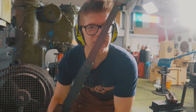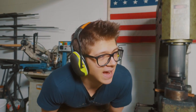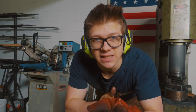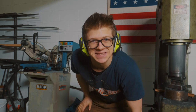So I've made two different sizes. One is 23 by 10 and one is 20 by 9. We're gonna see if that helps us get any closer to reducing that flashing and getting a very nice and clean forging. I also found pushing in, it's very difficult to do because it takes such an aggressive bite. A constant feed in is difficult. Instead, I'm gonna be working mostly on drawing through the dies, pulling back towards myself.